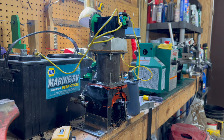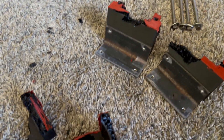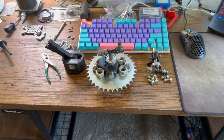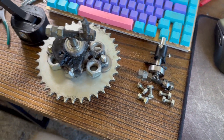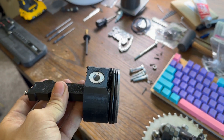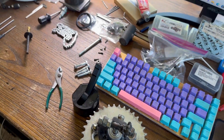Starting at the upper end, everything looks just fine except for plastic shards everywhere. The crank case is in about eight different pieces. One of the all-thread rods is bent but I'll just put that in a vice and bend it back. The crankshaft will have to be remade — one of the pieces is gone, that might be what hit my face shield. The welds broke on the crankshaft — that's the only thing that broke — right where my welds were, probably because I used a very cheap welder. I think the piston was fine until the crankshaft got slammed into the base.